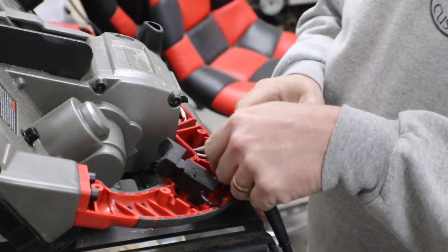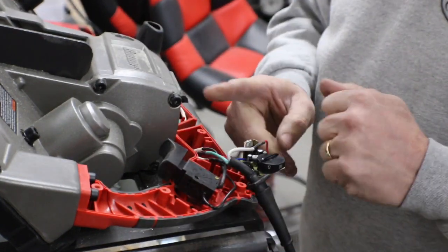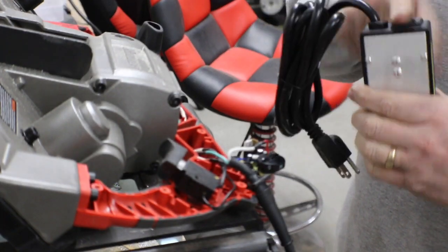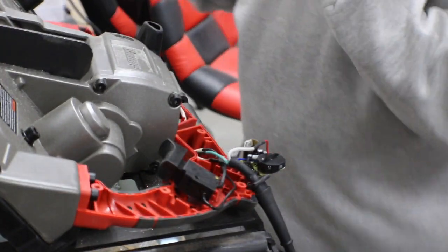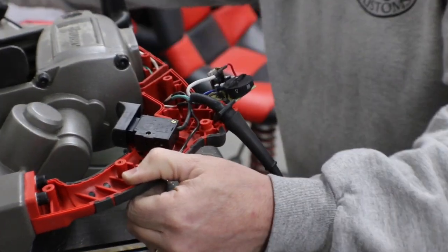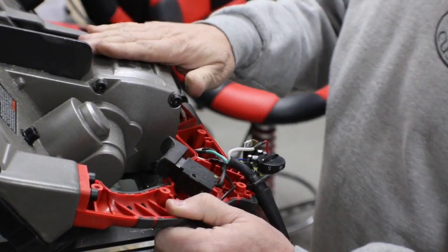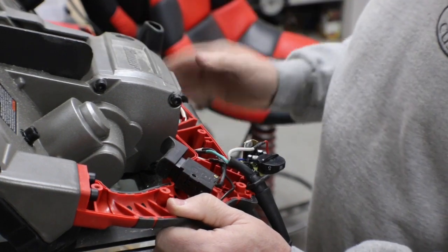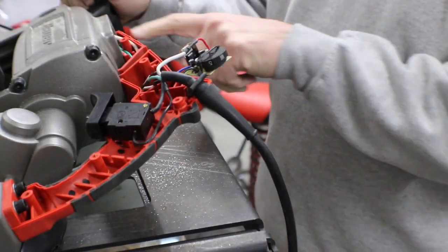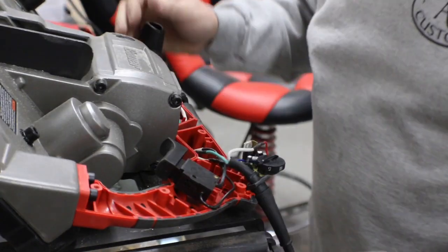But I'm thinking I can probably just cut them all here, remove all of this, and then just take those three wires and plumb them straight into this box. And then we may even be able to cleverly mount the box on the back or the side of the bandsaw rather than even the side here, but it doesn't really matter. Worst case, we would just end up making a little cover plate back here to cover up where the wires are coming out, which might actually be easier.